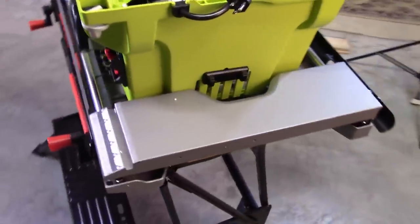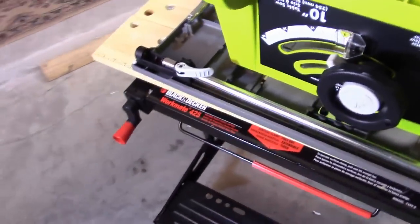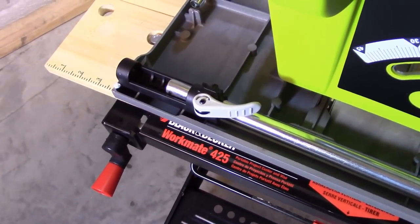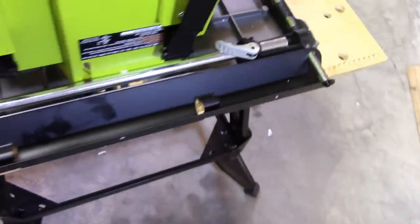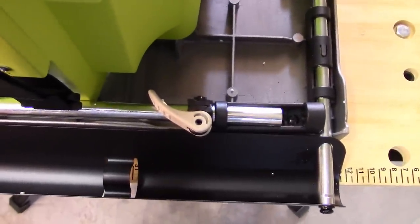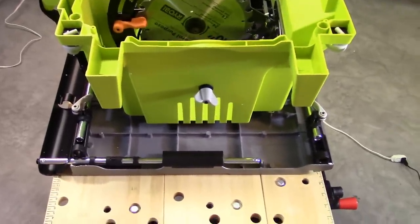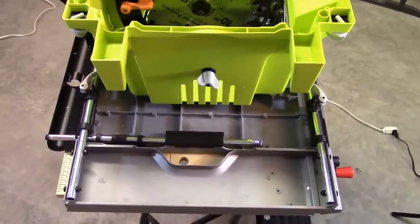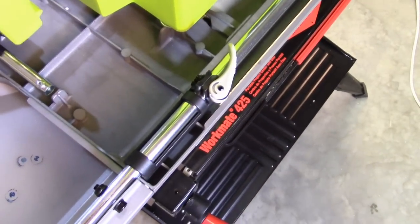The next thing you want to do is unpack or remove the right-hand extension, which is packed upside down on the saw. Release that latch, and you'll notice that panel is upside down — we're going to flip that over, unlatch the other latch, and then put it into both of those two slots and close the two latches down. This is what it looks like installed correctly: you flip that panel over and lock down the latch, seeing how it fits into the slot. The same thing on the other side. That's how you install the right-hand extension panel.